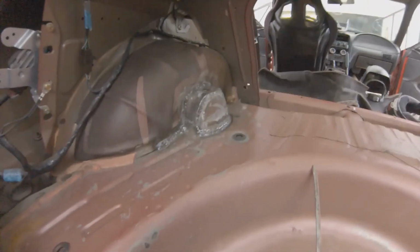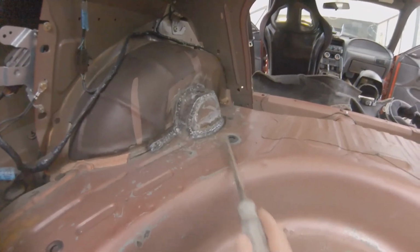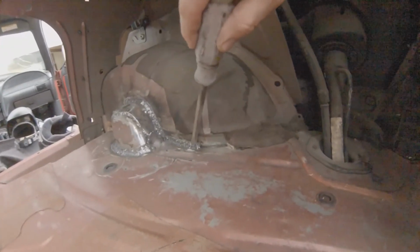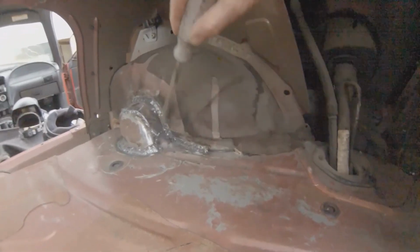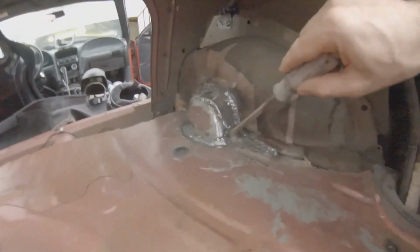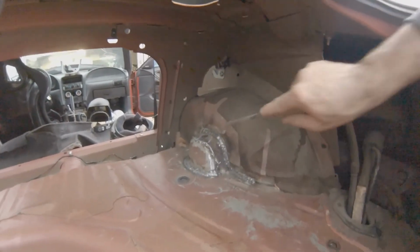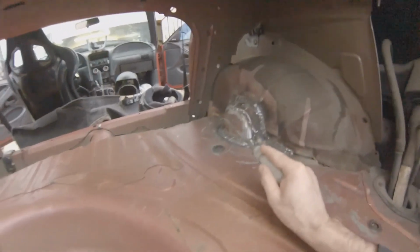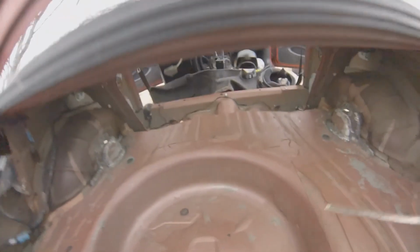That kept it from burning through the thin stuff. And then the leftover pieces I used right here to fill this gap a little bit, and back here. And I did that for both sides. So there's another piece of that 1/8 inch rod sitting in there, around here, and then back there. And then you can see that this is welded up. So that just ties everything together. And then I do use a strut brace that comes from here across, just to add some more rigidity.